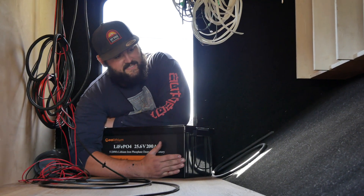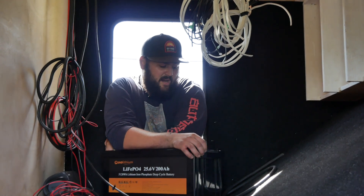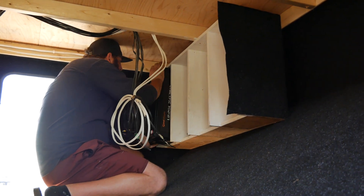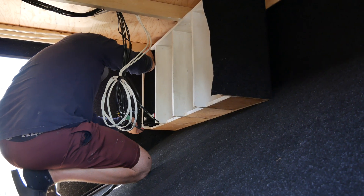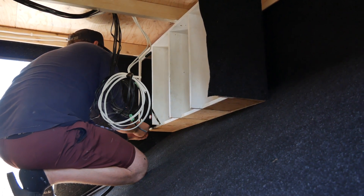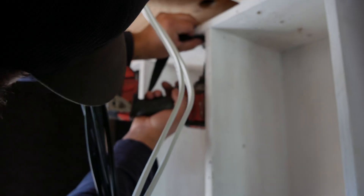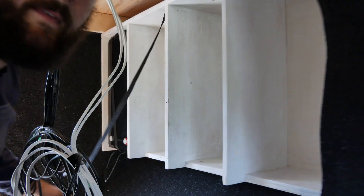It's a 24 volt system. We debated between going 24 volt or 48 and doing an all-in-one system, but we didn't go that route. We went with all Victron products. The only thing we didn't do is go with the Cerbo GX, because the smart shunt is Bluetooth and if you've got a tablet mounted on the wall that's good enough — it's unnecessary to go with the Cerbo anymore. We're going to install these. They're quite heavy — 39 kilograms each, that's about 80 pounds — and we're going to strap them with a strap across every battery.